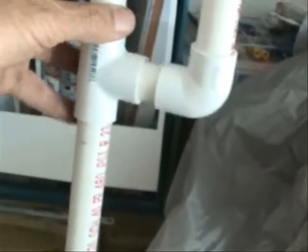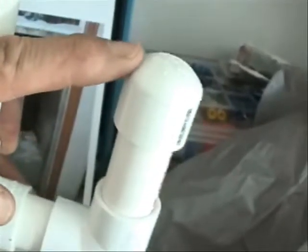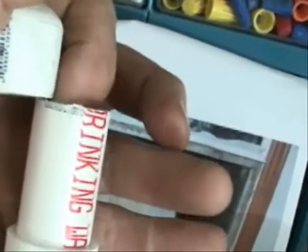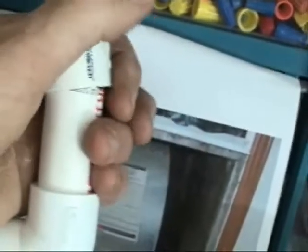That's not to say you don't need a trap. Another option, which is kind of a smart option, is instead of just connecting the pipe together with a coupling, you can use a T. Then you put a small piece of pipe, followed by a three-quarter inch 90 and another small piece of pipe, and then you put a cap on here. Glue all this together using PVC glue — but do not glue the cap on, because that defeats the whole purpose. This way you'll be able to remove the cap and use this as a cleanout for your condensate drain. This is an option you might want to choose rather than just putting in a three-quarter inch coupling.